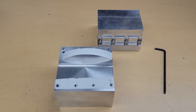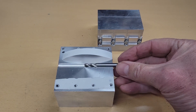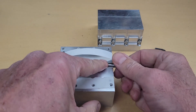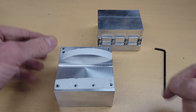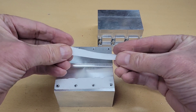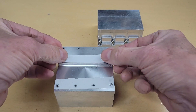I'm going to screw the sump onto the crankcase and put this pin in here. This will be used as a reference in the lathe. Once I get that determined, I'll pull this out and then bore the hole. This right here is 10 thousandths thick Teflon that I'll be using for my gasket material. I'll tighten these down.